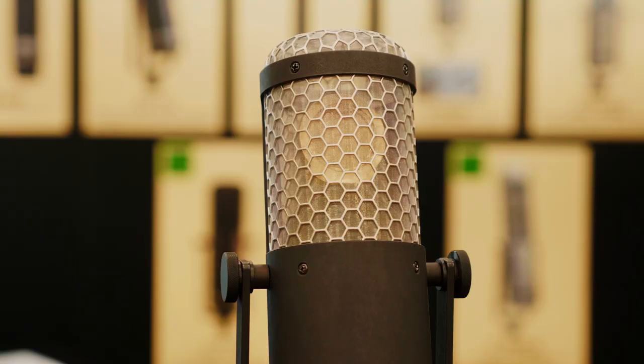We're standing behind your product launch for the show, which is the C705. This is a new and somewhat more affordable version of an existing microphone. The 705 leverages off our already existing 715. Like the 715, it has our large single diaphragm center-supported capsule. However, in the 705 we do away with the Omni setting. Omni is helpful sometimes, but really most of the time people use this capsule in cardioid mode, so that was the first thing to go away. The other thing that went away was the large nickel-core Lundahl transformer, so this is an active balanced out, or transformerless, design.